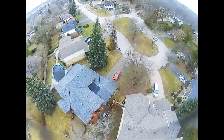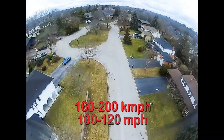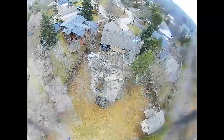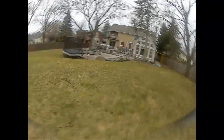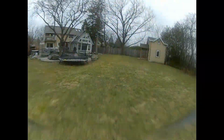But how fast does it go? With 650mAh batteries, I repeated 2-second full throttle bursts and measured the top speed to be around 160 to 200 kilometers per hour, which is around 100 to 120 miles per hour. On the 550mAh battery, it sagged below 14 volts near the end of a burst, so that gives you an idea of how much full throttle it can sustain. Flight testing with 750, 650, and 550mAh batteries — each drop gives a noticeably lighter and more agile feel to the flight performance, especially when moving to 550. The 550mAh batteries feel really good if you can get away with it.